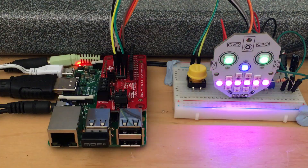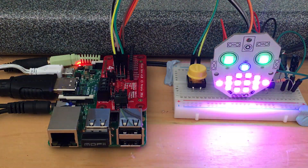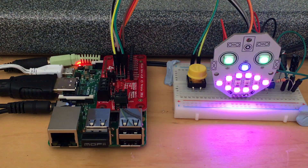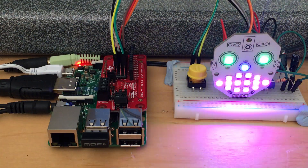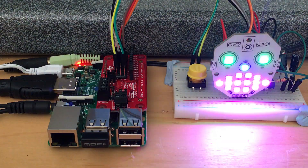I receive an audio signal from a microphone on my master's iMac and that is picking up his voice. It is fed into the circuit on the board behind me, goes through two capacitors, and from there it is fed into an analogue to digital converter on the PicoZero board which is mounted on the Raspberry Pi beside me. This feeds a signal into the Python program which is controlling me, and there the program decides when to open my mouth and when to close it depending upon what is being fed in via the audio input.